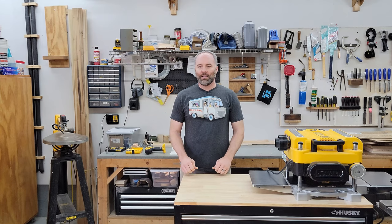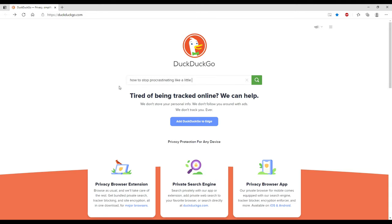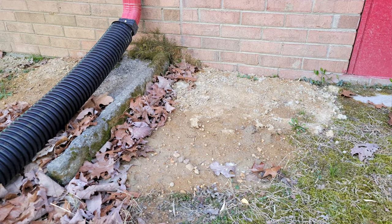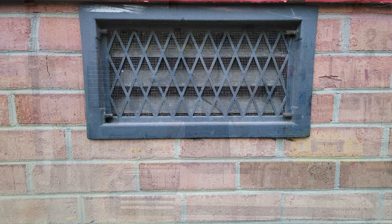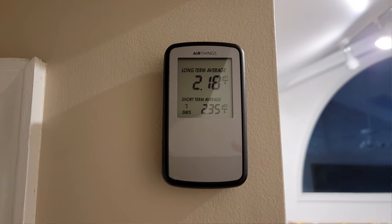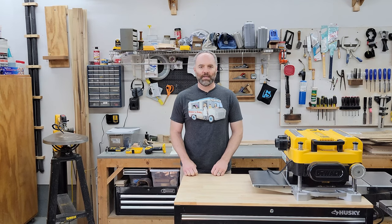While we were having these discussions, I did a lot of reading and watched a lot of videos about crawl space encapsulation, just to learn everything I could. I started working on some other mitigation options, such as improving the gradient around the house to try to pull more water away from areas that I thought might be problematic. I also opened up the vents around the perimeter of the crawl space — there were about six vents and they were mostly closed. After I opened up those vents, within a week my radon levels were half of what they were before. Just by allowing the air to pass through a little bit more removed a lot of that gas. It's nice to know that my family is breathing less radioactive gas now.